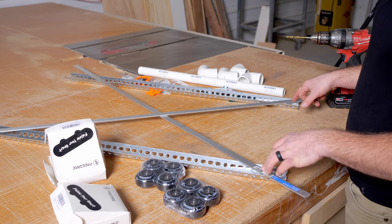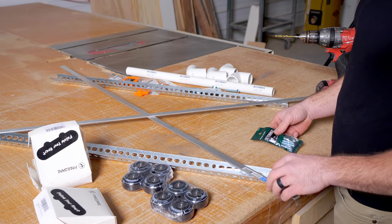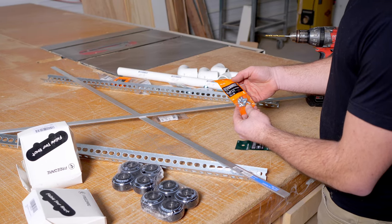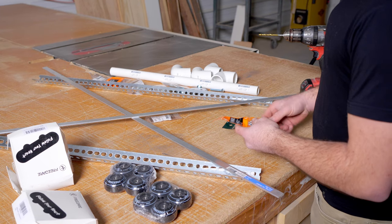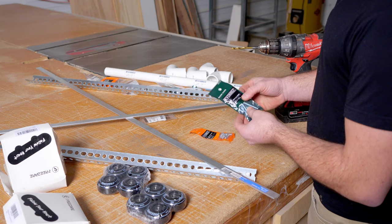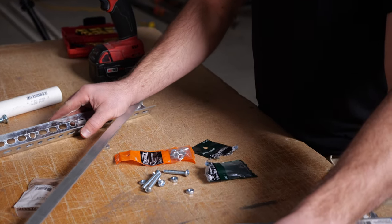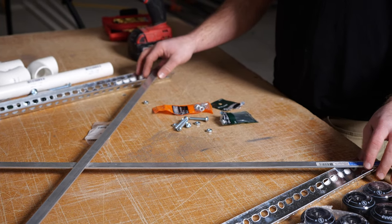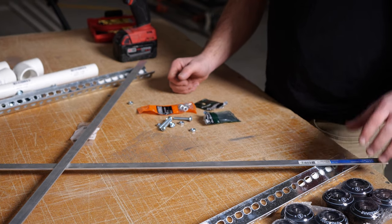Just a couple of screw holes in the ends of each of the flat bars and down into the angle iron, and that will house our bolts that will hold the aluminum flat stock to the angle bracket. I have just a couple of wing nuts so I can loosen those up, take them off, fold it in, and then it'll be easier for storage. Grab the appropriate drill bit for your screws — I ended up getting quarter-inch by 20, and I went with inch-and-a-half bolts. The main concern is to make sure this is the width we want for our tripod. Whatever tripod we're using will dictate how wide to make this and therefore how wide my dolly rails will be. I'm going to go measure my tripod and be right back.